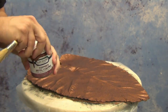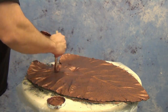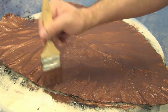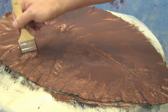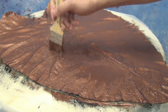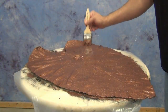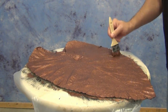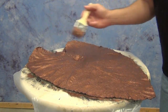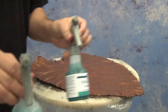Timing is really key for the second coat of copper B. To get a nice oxidized copper surface, we apply the copper B all over the part again, stipple out the brush strokes, and then very quickly transition to applying our patina. This is an acid patina, so we need to apply it immediately while that second coat of copper B metal coating is still wet on the surface. If we allow it to dry we're going to get little to no reaction.